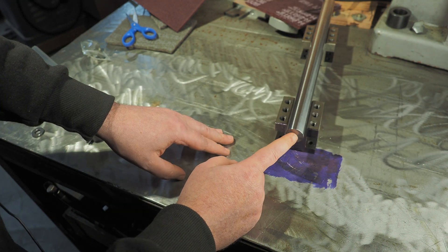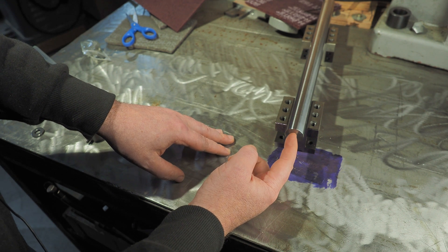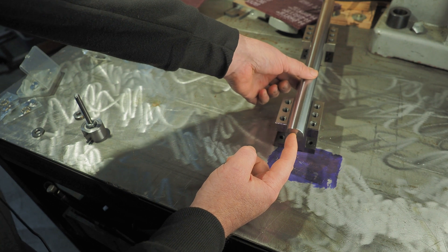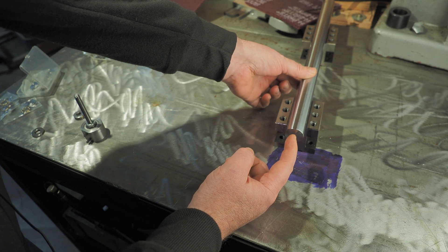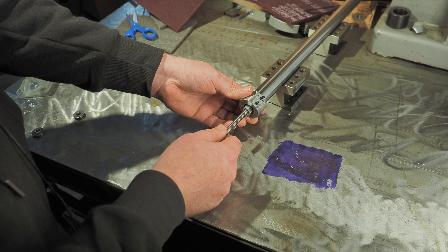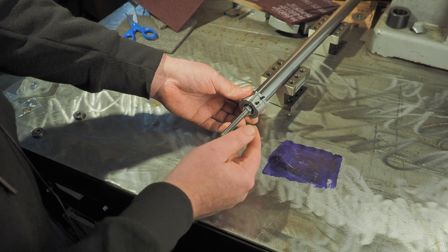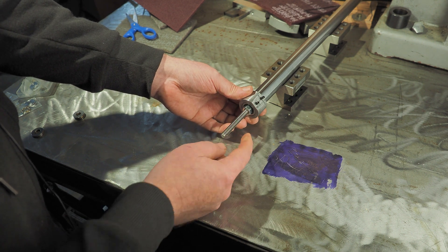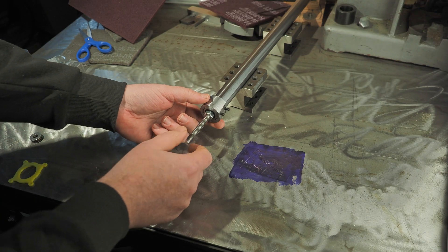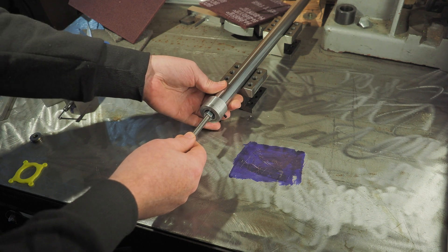The only other thing I'll point out is that I did turn both sides of this on the lathe because I want to be able to put an indicator on here and not have to get it exactly in the center - that way I can measure exactly how much linear in-out I have. This is just a press fit on here, it's a pretty tight fit. And I have a block that sits on this end that when you roll the screw it'll do the linear motion. So we've got the way to get our linear motion and rotary motion.